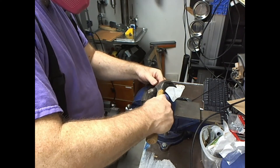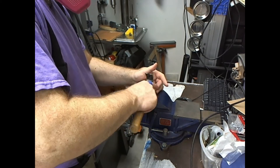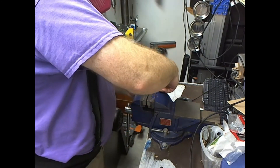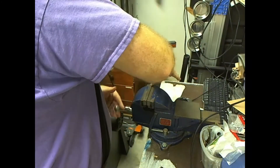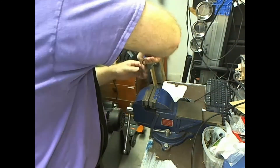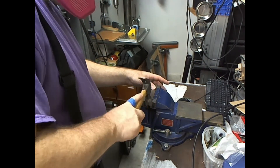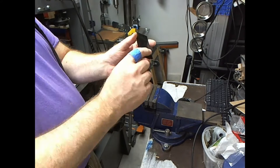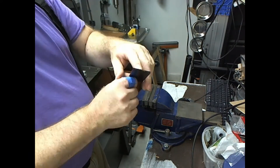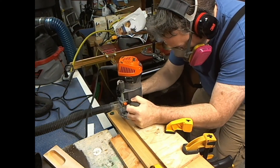To get the metal piece out, you need a little bend at the end, so I'm making a tiny L-tab. I put it in the vise and carefully pounded over the end, but it wasn't quite straight, so I flipped it and worked the other side to straighten it out a bit more. Now it's got a square corner on the end — you just reach in, grab the L with your thumb, and pull.